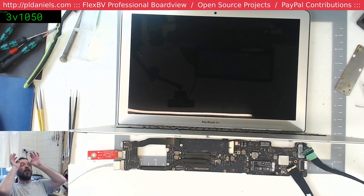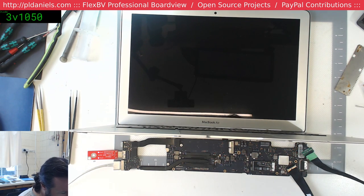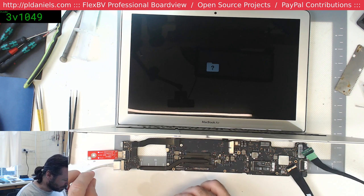Come on, give me back up. I'm fairly sure that we're going to have to put a new driver on there, and that's going to be fun because, oh, well there we go. So it was one of those parts. Something was wrong with one of those parts. Either that or maybe one of the balls under the driver hadn't quite reflowed, although I was fairly sure that I got them all, because it did wiggle and dance.